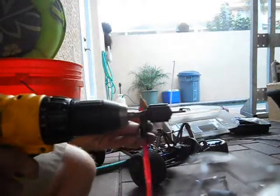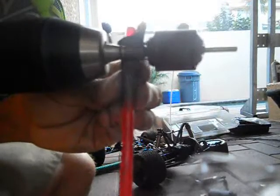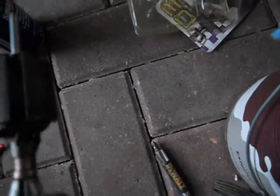Now you see as we do this, it's getting cleaner and cleaner. We're basically cleaning up the commutator with sandpaper. As you can see, the dust spot right here is pretty clean, but this commutator is hammered — it actually has worn spots in it, so it's a junk motor. But we're just doing it for demonstrative purposes.